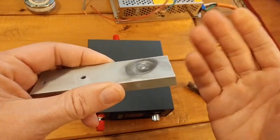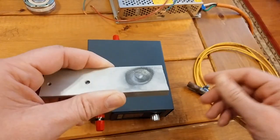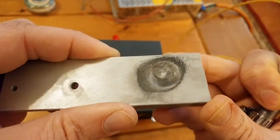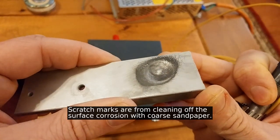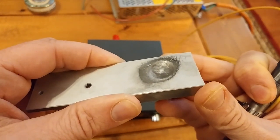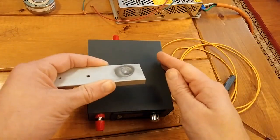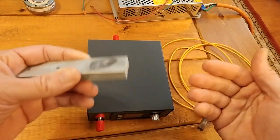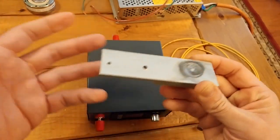I took a little piece of scrap, set up a pump basically flowing salt water over it — flooding it — and hooked up all the wires. I took an electrode and just by hand put this little dent in a piece of aluminum, and that is pretty cool. It was just like 10 minutes, it wasn't very fast, but I think I can make this much, much faster and much more accurate too. Because it's programmable, I can tie this into a CNC machine and no matter how long it takes it doesn't matter because I won't be there having to do it.